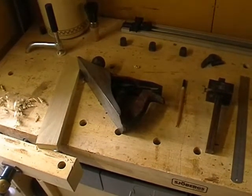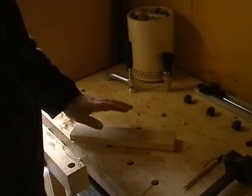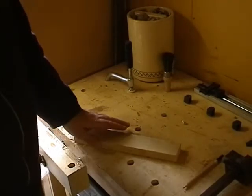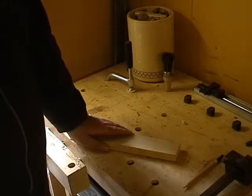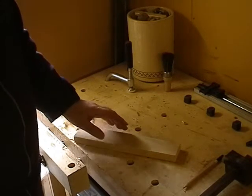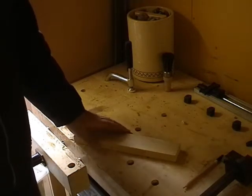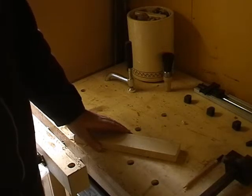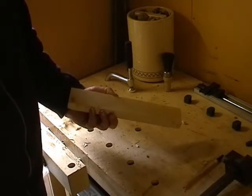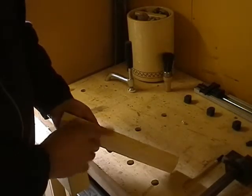The wood this time is canary whitewood. In schools, when given a piece of wood, the first thing we're asked to do is to select face side and face edge. In real life, if I were to make a practice woodwork joint, I wouldn't be looking for a face side face edge — I'd be looking for a datum line. So before we choose, we'll look at the face side and the edges and choose one.